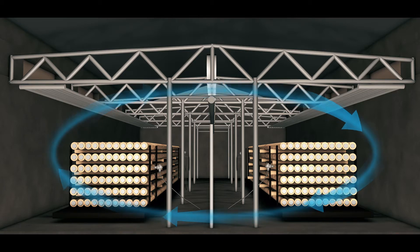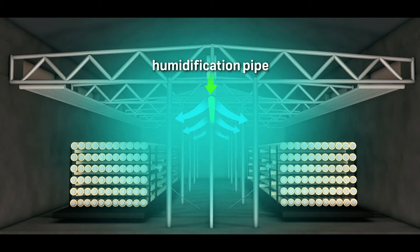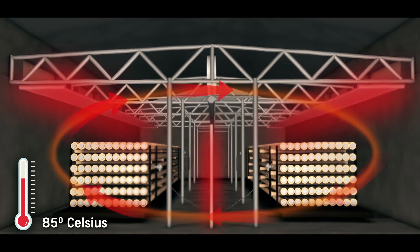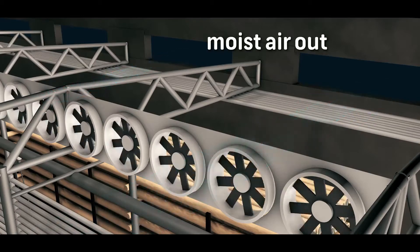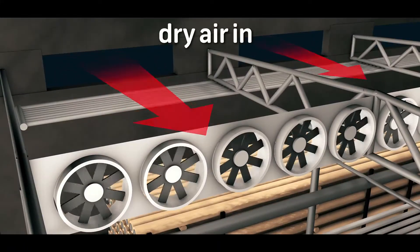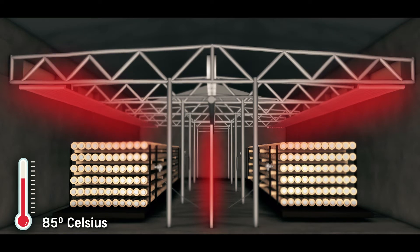Forced air with fans in the kiln moves through the air stack. Through the use of steam, moisture is introduced through the humidification pipe. With the implementation of the next heating phase, the room temperature rises from 50 to 85 degrees Celsius. To ensure the timber is dried evenly, the direction of the airflow constantly changes from clockwise to anti-clockwise. When the wet bulb registers that the air moisture has reached a certain point, the vents will open and release the moist air and pull in more dry air from outside. The process is repeated until the desired moisture content is achieved. The final equalization process will then take place, where the room temperature is brought down from 85 degrees Celsius to 60 degrees Celsius.